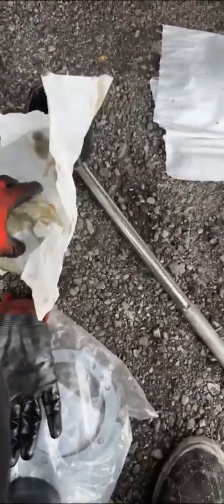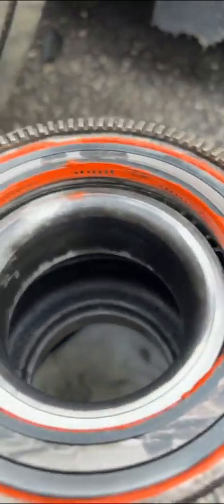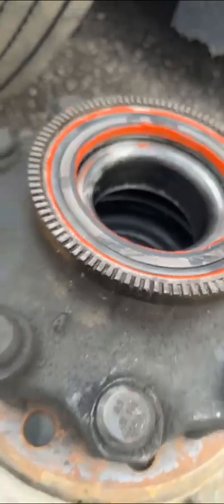What this keeps in place is the bearing — so the weight doesn't push forward and move the seal off its place. The hub is heavy, so the weight shouldn't push forward. Just a light coat — be careful not to put it in the middle, that's what the little seal spring is for. It's almost complete.